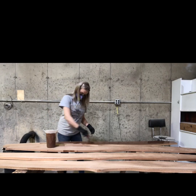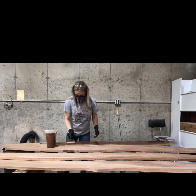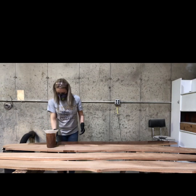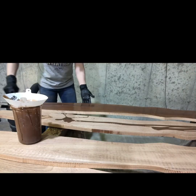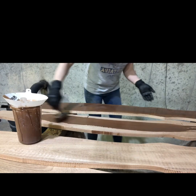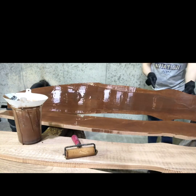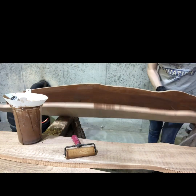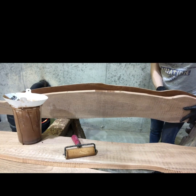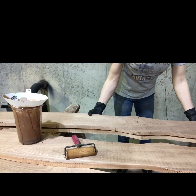The glue has a 15-minute setup time, so from the time I mix it I have about 15 minutes to get the prop completely glued up. For a larger prop — this one is almost 90 inches — it's kind of a challenge, and mahogany really soaks up the glue, so I had to mix a couple of different batches. You can see how I pin them together with that little hole I drilled earlier to keep them all in alignment.